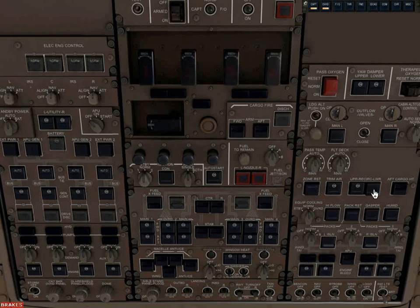We can now turn our recirculation fans on — make sure everybody's comfortable. All the fuel pumps are running, all the hydraulics are online, all four engine generators are online, the APU is off, starters are disengaged, auto-start is on. Con is continuous ignition — we won't need that; that's if you're going into a storm. No anti-ice needed today because it's such a nice day, and we can go ahead and turn on our aircraft lights.